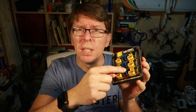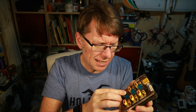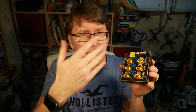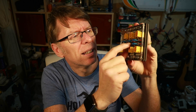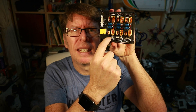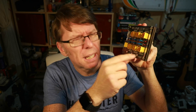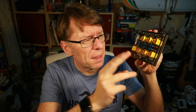You've got individual fuses — these blue things here — which are replaceable; you can pull them out and if you blow one you can replace it. The idea is this is set up around safety, so there's a fuse for each port that should blow if there's a short. You also get little red LEDs that light up, and there's even a little alarm. Along the balance ports there are little blue LEDs — if the balance connector is plugged in the wrong way around, that should light up and stop you doing things.